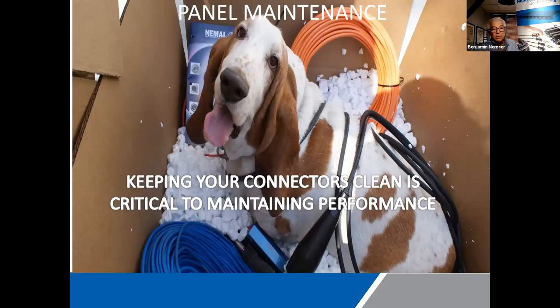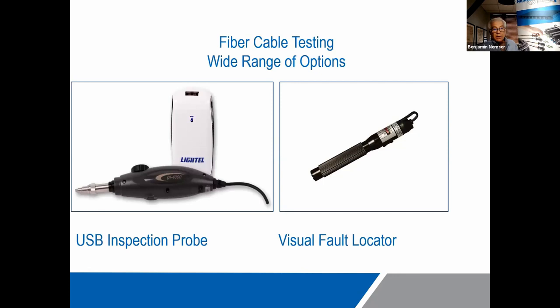So it is critical to keep all these connectors clean, and there are a number of things that you can do both to check as well as to actually do the cleaning and test. The inspection probe is one of the most useful pieces of equipment. These come in many different models. We have the Lightel, which is what we use. We also sell them if you would like to buy one. But they're a USB probe. Danny's going to give a really good demo, and they come with different tips for the different sizes of ferrules that you use.